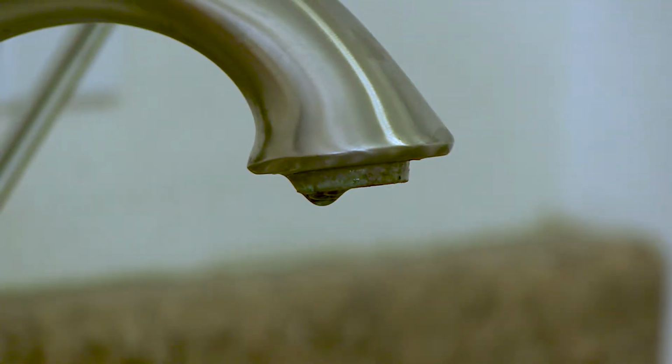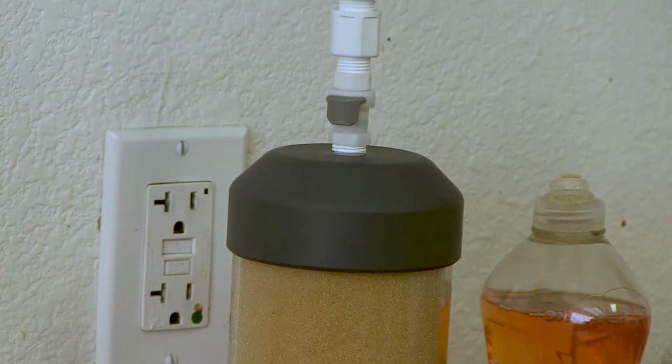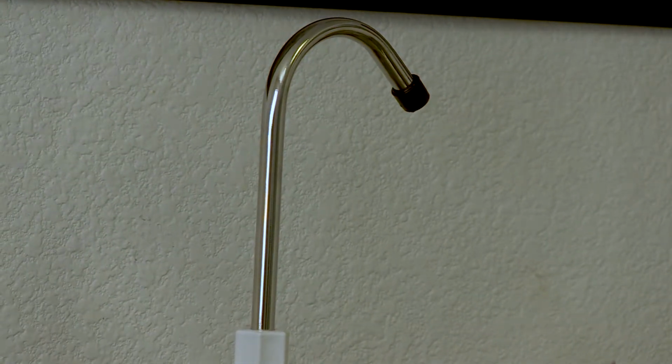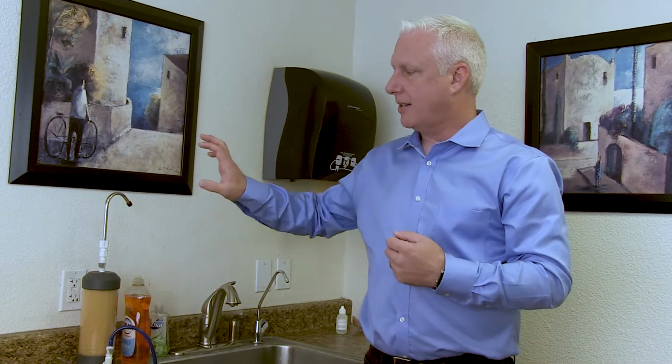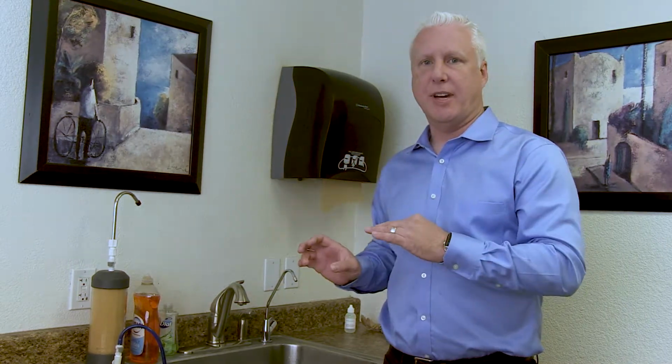So the best thing to do in a situation like this is to have a professional plumber come out, test your water, see where it's sitting at, and then have a custom application designed for it. Certain companies, and companies that we use, actually design the water conditioning around the usage of the homeowner and not just a one-size-fits-all package. It's sized to the house, it's sized to the consumption, the number of people living there, so it's a solution that fits the needs of the actual homeowner.